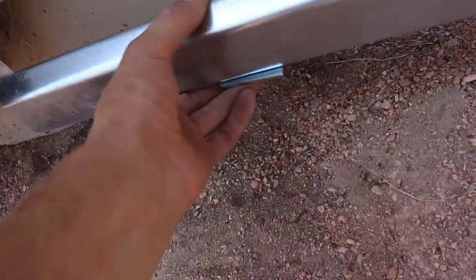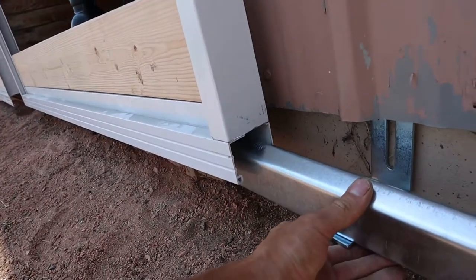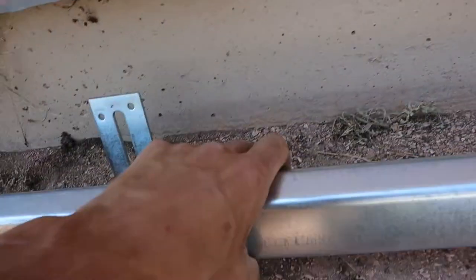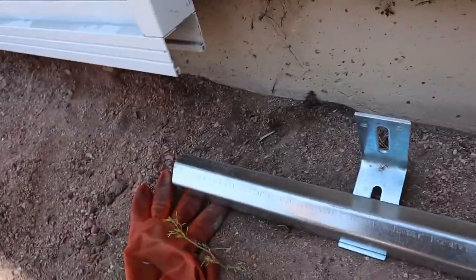So we're gonna go ahead. Hold on, getting away from me. We're gonna hold this up where we want, the right height where it has a little bit of bend, and go ahead and bolt it. Go ahead, hammer drill in the concrete, put some wedge anchors in and bolt it. Probably won't be very pretty doing it, but we'll get it done.